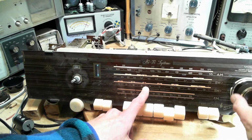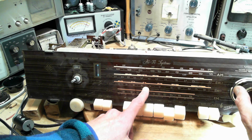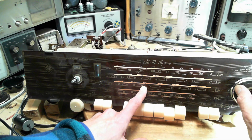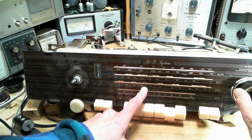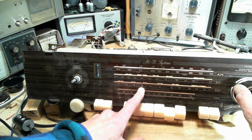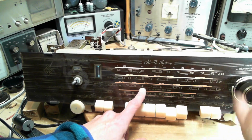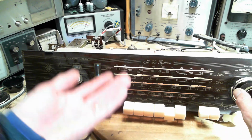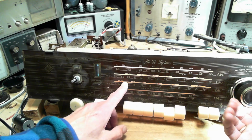15 megahertz. You should get one at 15,770. There's that tapping sound again. What could that possibly be? That thing haunts me. I think the tapping gets louder. I think it's indicating the general sensitivity of the radio is getting better, plus background noise shows up here.